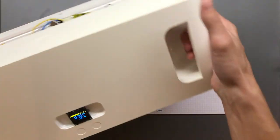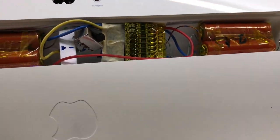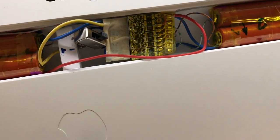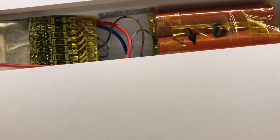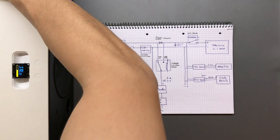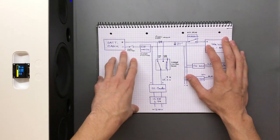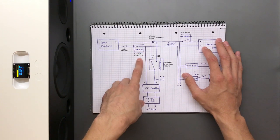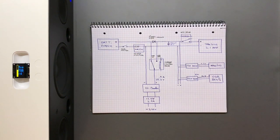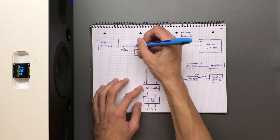The balancing circuit is visible on the back — I'll remove that paper tape and make it look nicer. Below that is the protection circuit, and I'll add links to all these parts in the description. From there it goes to a switch, through the power monitor. The power monitor also needs a feed from the positive rail so it can read the voltage.